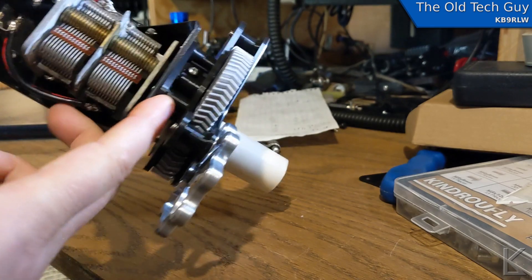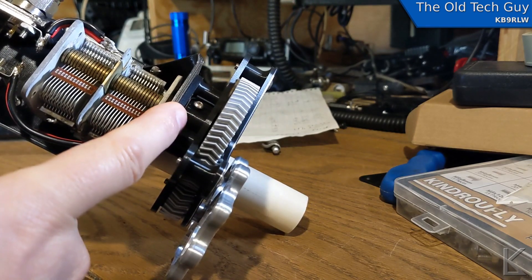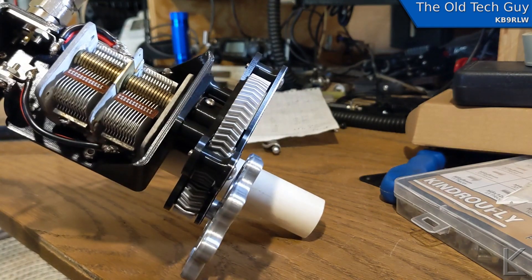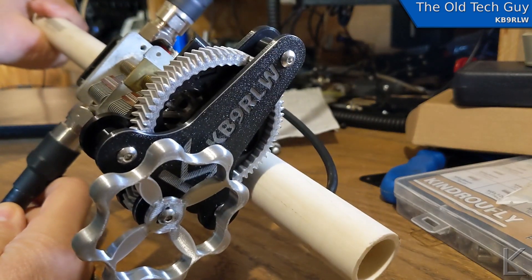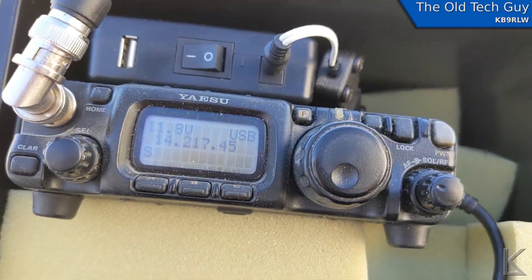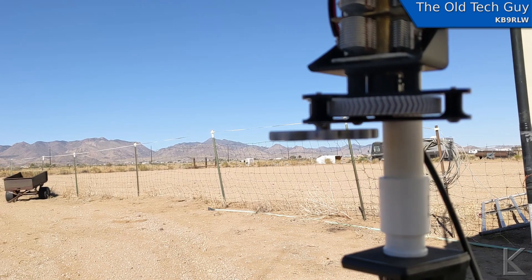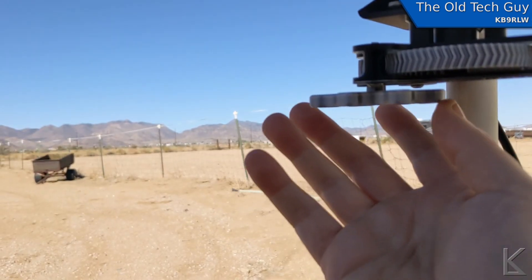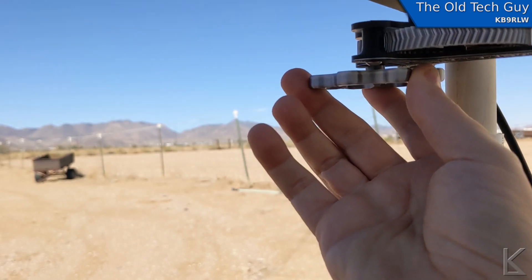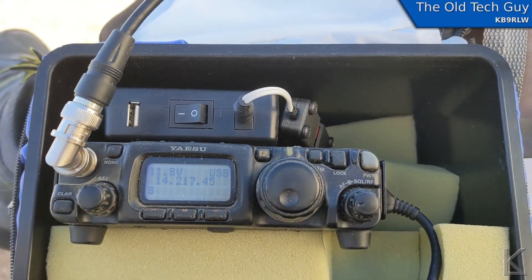This standoff is kind of universal. I made a little template so you could mount this on the front of your own magnetic loop build, center the capacitor shaft through there, and then mount the frame and the gears to that. It goes together pretty easy — I made an assembly video. That will be linked to the Thingiverse page where you can download the STLs if you want to make that gear reduction for the front of your magnetic loop. I'm on 20 meters, and just so you can see — even with the gear-down drive, it is still very, very sensitive in tuning because the bands are so narrow. Listen for the static on the radio.